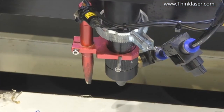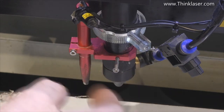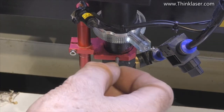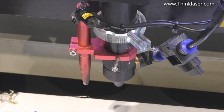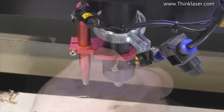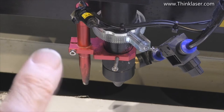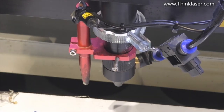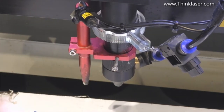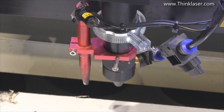Before we look at how we set this pen relative to the nozzle, I'm going to be a bit rude and say I am not very much in love with this piece of engineering. It's aluminium, it's very fragile. I've actually got thumb screws in here as opposed to the cap head screws that were there originally, because you only need the smallest amount of pressure with an allen key to strip the thread. You can still wobble it — you can't put enough pressure on it to clamp it really securely. So before I show you how to set this up, I'm going to make a radical change and replace this with my own design.